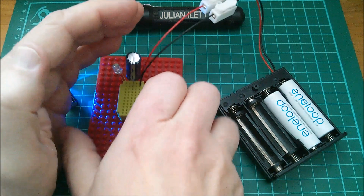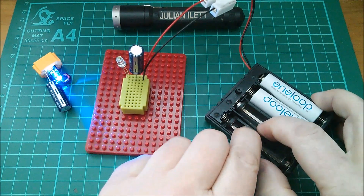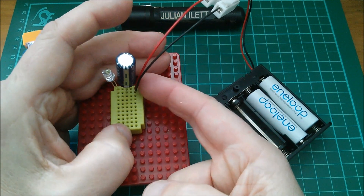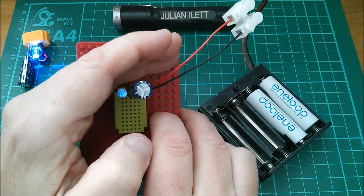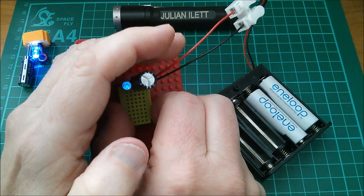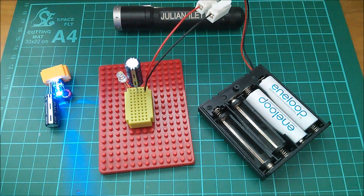So that's what I've been playing with — a 2.5 volt voltage source with quite substantial current capability, charging up the capacitor. That is just coming up — if the connections on these two are high resistance, of course we're going to get less current flowing between batteries and capacitor. But yeah, that is just a quick and dirty supercapacitor charger with a little indicator light showing that one coming up gradually. This one's still working fine. Cheerio!